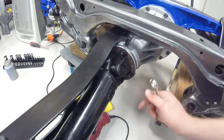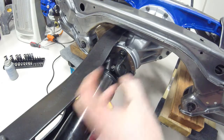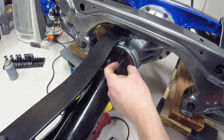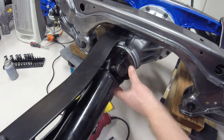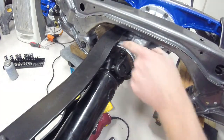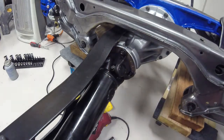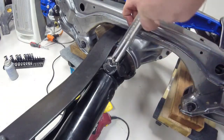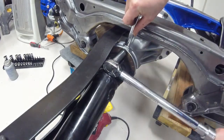You want to do this loosely, as you want to make sure the driveshaft can fit around the pinion shaft. So basically once you have it to where it's sealed good against the surface and even, then you can go ahead and hand-tighten all your bolts. The torque spec in my factory service manual is 22 foot-pounds of torque, so I will do this in a criss-cross pattern.